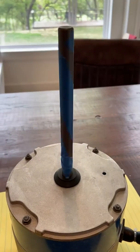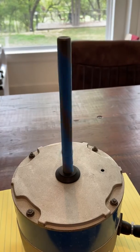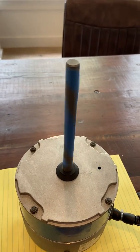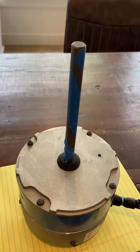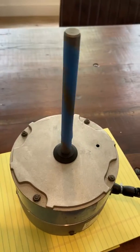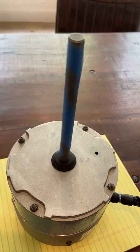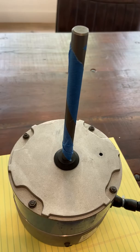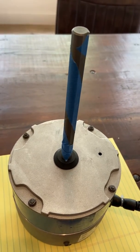Hopefully this is where that tape is going to come in handy. As you can see, it's spinning fast in a counterclockwise direction. So if I cut the power right now, when I hook that motor back up to 230 volt, it's going to be a fast 1075 counterclockwise motor. Now I didn't unplug it, but you notice it stopped on its own, and again it came up spinning fast — but this time clockwise. So if I unplug it now, when I hook it up to 230 volt, it'll be a fast 1075 clockwise motor.